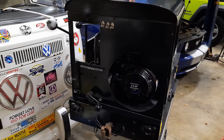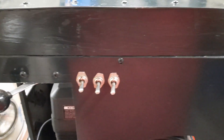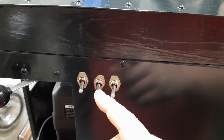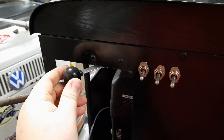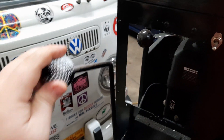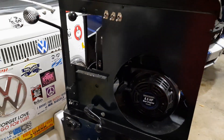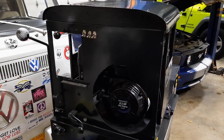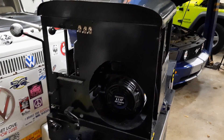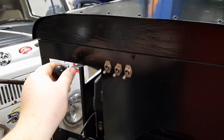If I was sitting on a riding car behind the locomotive operating it, there are a handful of controls back here. There are a set of three switches in the center — one being the ignition, another the light, and the third just filling a blank hole. To the left there is the throttle for the engine, a hand brake, and down at the bottom simply forward and reverse. This engine does not have a clutch; when you throttle up, the centrifugal go-kart type clutch engages and you start moving. You have to be very touchy with the throttle — just the slightest movement and you'll start moving.